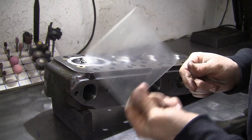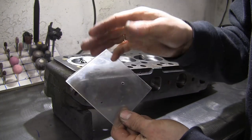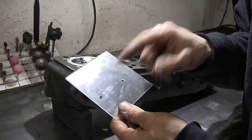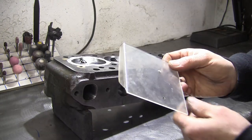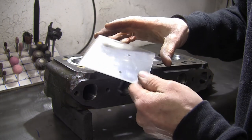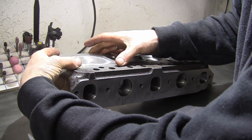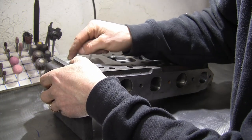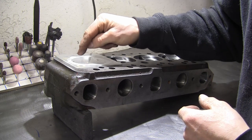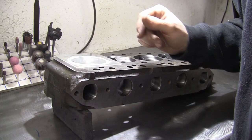For the next bit, I've got an old bit of clear perspex. It's got two holes drilled in it - one you're going to use to fill up with the liquid, and the other one is going to allow the air in the chamber to expel. If you try and do it with one hole, it's not going to work properly. We're going to use this to seal off the chamber. I've put a smear of grease around the edge of the chamber to seal it. I'm just going to put this on top and gently push it down around the edges, and that seals off the chamber. The liquid will fill and go to the top via one hole, and the air is going to come out of the other hole at the very end of the chamber. When it's full of liquid, we can read off and that will give us our measurement of the volume.